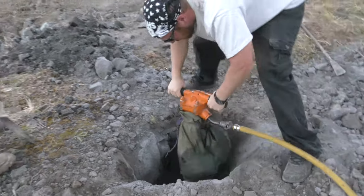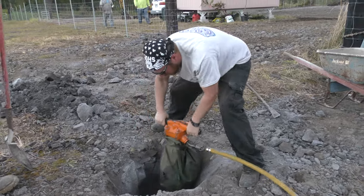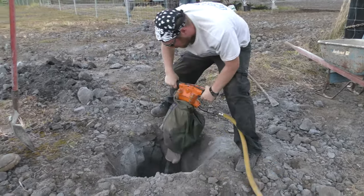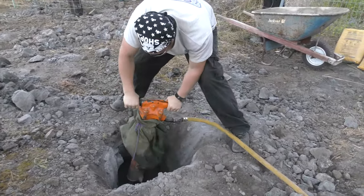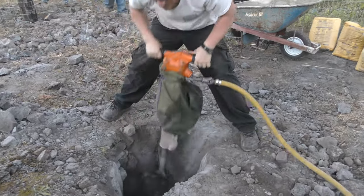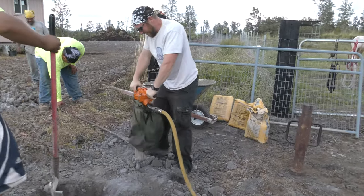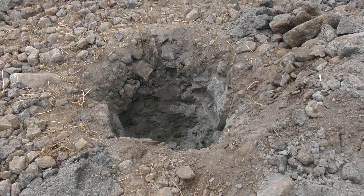Putting in a fence on rock isn't easy. There's really no easy way to go about it. I figured the best way was to use Helco or the big telephone poles in the corner for corner supports, because it cut down my cost so I didn't have to put in H-bracing or corner bracing, which usually uses three or more pieces of wood.